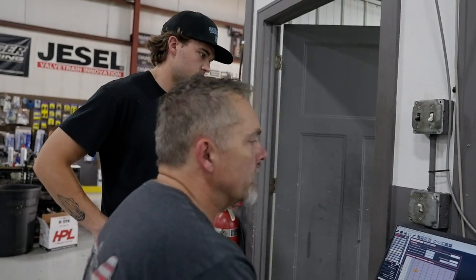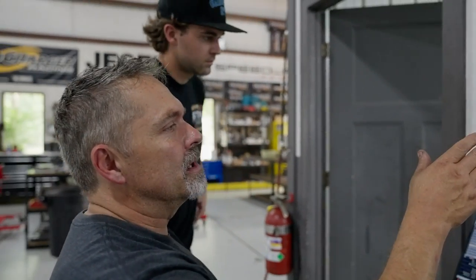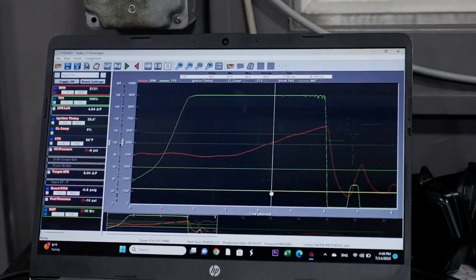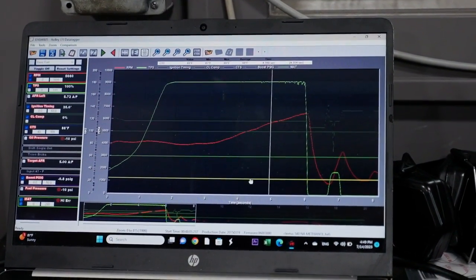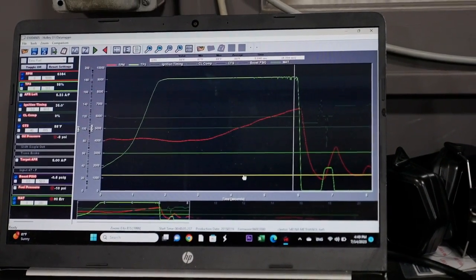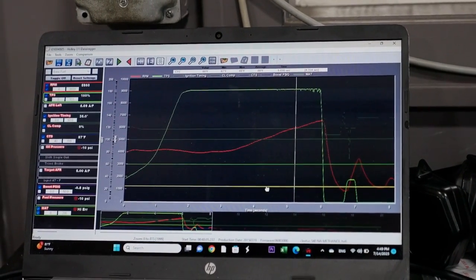My bad. Well, I don't have a coolant temp sending unit in it, because that would go somewhere else in the system. So I had it starting at a minimum temperature. Well, it never reaches that temperature because it's unplugged. So the whole time it thought coolant temp was 88 degrees, and I was telling it to turn the closed loop compensation on at 100. So that's all looking pretty normal.